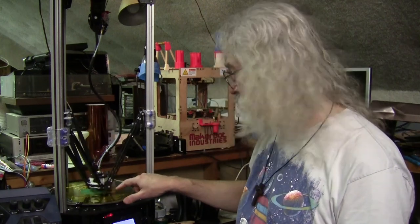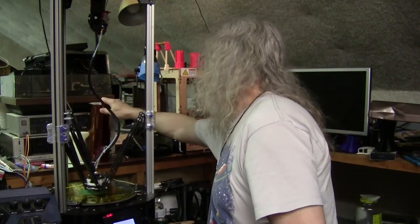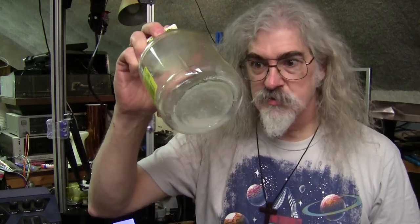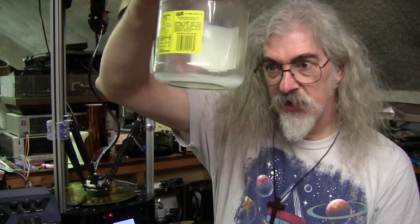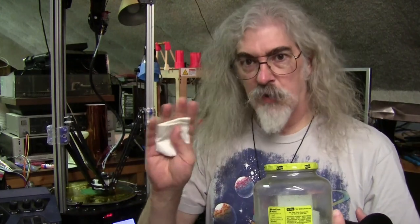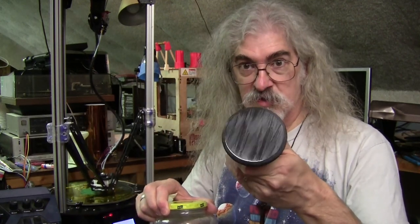On my glass I have a wide Kapton tape, and on the Kapton tape I've put down a slurry — this is natural ABS melted in acetone. Just a couple little pieces of natural ABS filament melted in acetone. Take that with a paper towel and wipe it on the surface. ABS and PLA both stick to it perfectly, and I get a really great surface finish. It's got a little bit of a dusting with smear marks back and forth from the acetone.